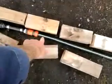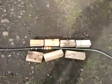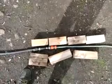If I disconnect this and give it a blow, it'll flow without a problem, but then it's going to give us trouble here. There's just so much line and air getting in the way of everything. Surprisingly, from here back, it seems to not really have a problem with airlocks, regardless of all the ups and downs under the house, back out, back down under the ground again and back up. Seems to all be pretty good there. But when it comes into here, this is where it gets a lot of carry-on. So if I put it there, then we're right in the middle of the two, and right where the connectors all are anyway, and we should be alright. You ain't going to believe this, but I've got enough here to do it with a 1/2 inch line running through a tap. So if it all goes wrong, I just turn the little tap off.